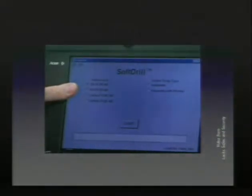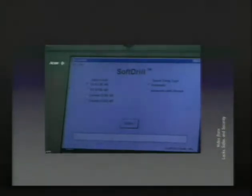Method 1 is my preference for manipulation: find wheel 3, 2, 1. That works 80% of the time. If Method 1 fails or I determine that I have a lock that is going to be difficult to manipulate, I can go to Method 2. In this case, the software searches the entire wheel pack. It might look for wheel 2 first, then 1, then 3. It's a longer process, but between these two, it's just about guaranteed to get the lock open. So let's see if we can get a go of it here.